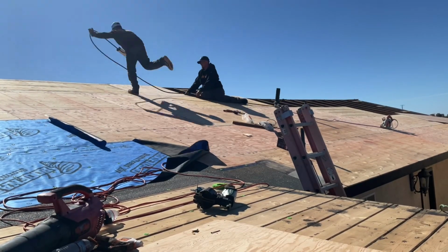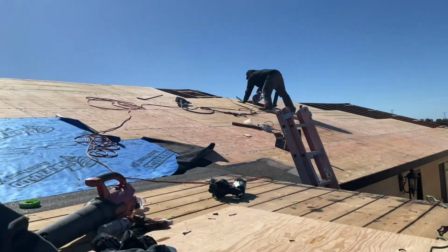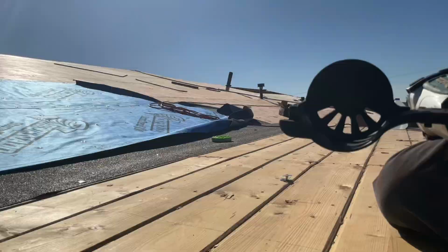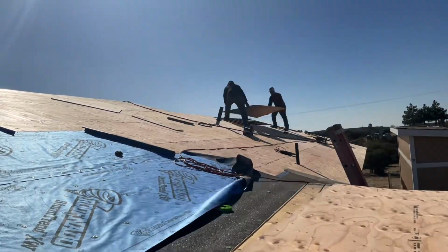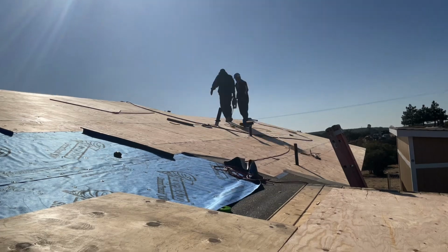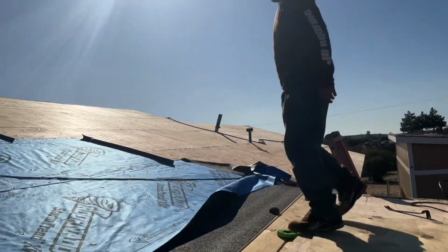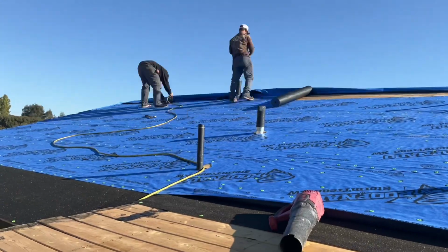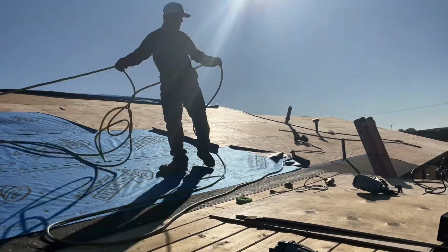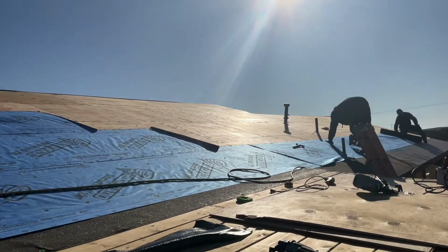Here we go. More wood. 1/2-inch CDX. We're using plywood clips and 2 per bay on the plywood to help with the sag of the plywood over time. If and when it ever gets wet, which will probably never happen, because the way we wrap this thing is just overbuilt, but you know, that's how we do stuff.